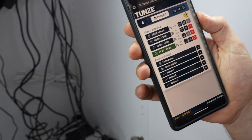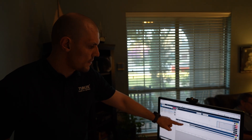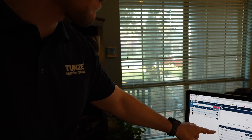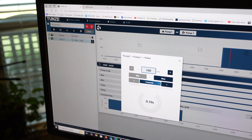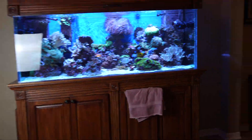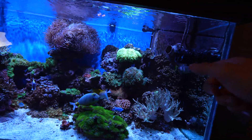We already made a video where we set up the full adjustment in English, so we'll leave a link in the description for more detail. For this video we want to just set up the wave. We don't want constant power — click on fast pulse. Set maximum power to 100% and minimum power to 0%. Then use this button to adjust the pulse time. For a tank of this size — about one meter — I use around 0.47 seconds. Click the play button next to it, and we're starting to get a wave already.